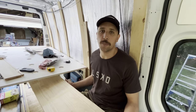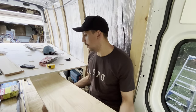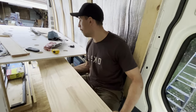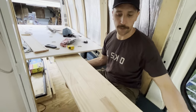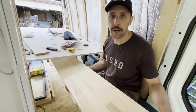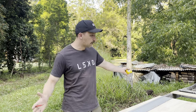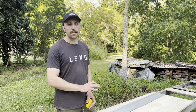It's been ridiculously hot today — just shy of 40 degrees — so we did a bit this morning, went for a swim, and that was pretty much the afternoon. Now we're going to crack on with the table. The plan is we've got a 600mm wide, 18mm pine laminate sheet from Bunnings. It'll sit on locking drawer slides so it slides in under there, locks out, and comes out about a meter. We're going 480mm wide or so. I've designed it in SketchUp but we might tweak as we go. The piece we've got is 1800 by 600, so we'll measure, cut, sand, and assemble it.